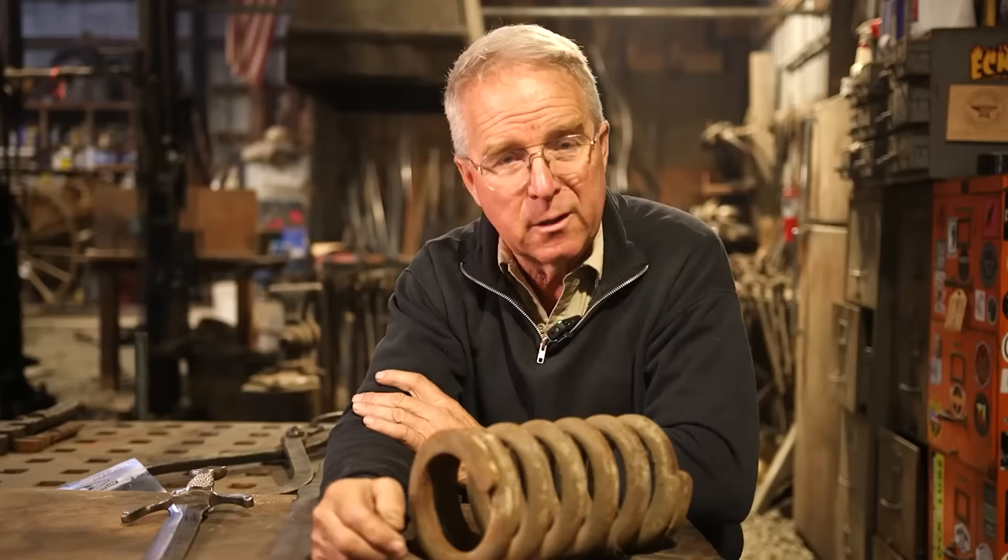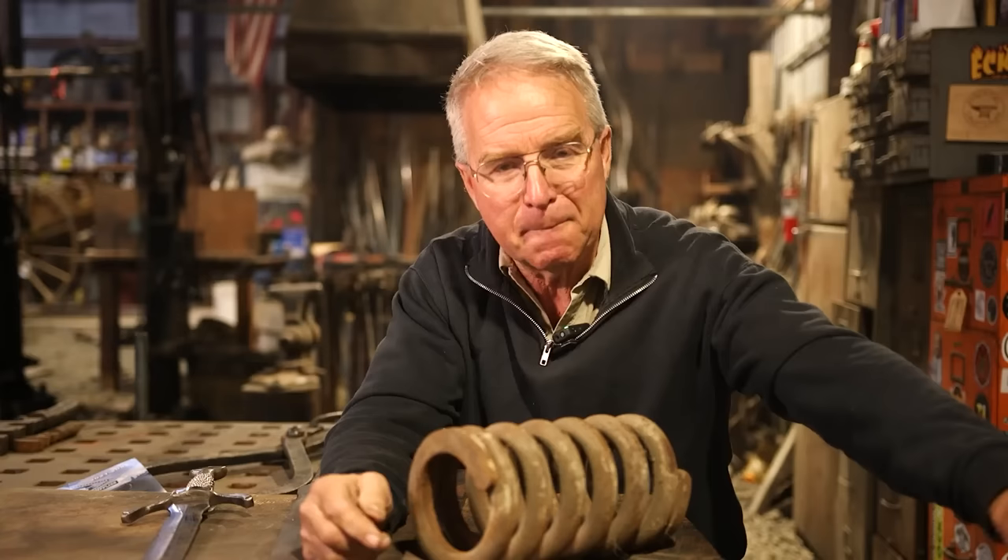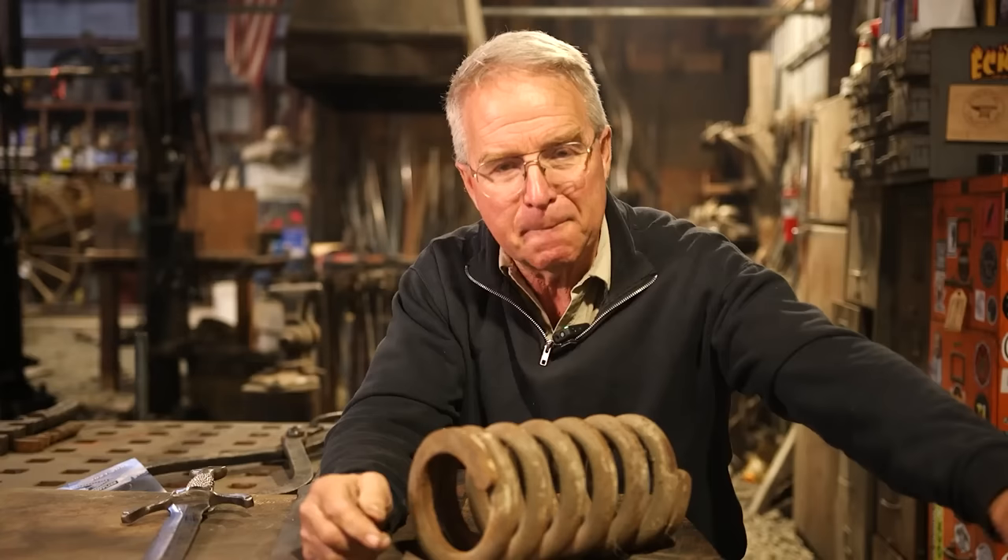It doesn't take long — it's amazing how easy we can get education and how long we put off getting it. So get educated about belts. And the second thing: when you're starting to grind knives, that fussy, meticulous process of visualizing what's going on where you can't see it — where at any moment you could wreck the piece — you've got to start thinking about your belts as if they're free. Stop squeezing the last 15 minutes out of every belt, because it's like the dull kitchen knife that cuts you, or the dull skill saw blade that screws up your fascia board. It's the dull belt on your 2x72 that's going to wreck that knife or cost you a lot of time retracing your steps.